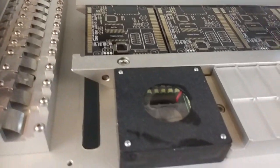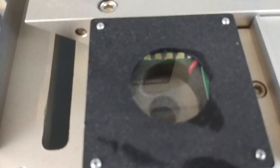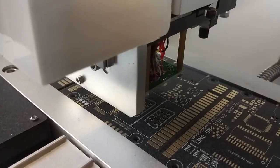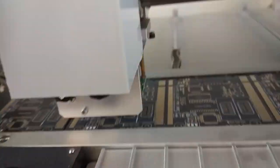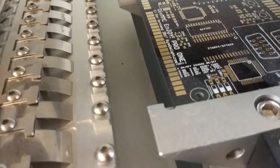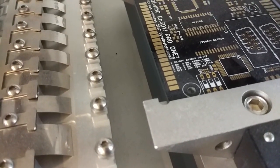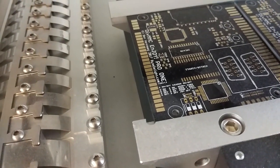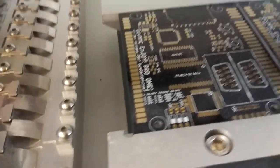There's some dust here — I'll clean it up. There's a bottom camera which checks if the chips are aligned properly — you put the chips in the tray here. There's also another camera in the back, with LEDs, which sees the top of the board. It can see the home points, the base locations, and the fiducial marks if you use them on your printed circuit boards.